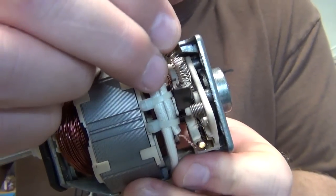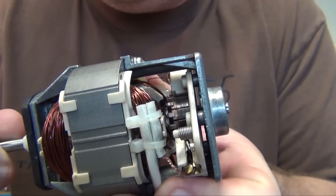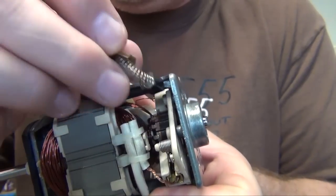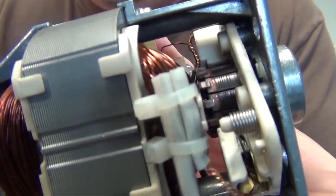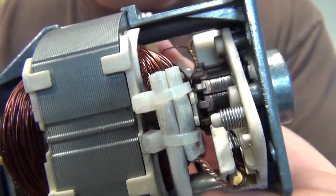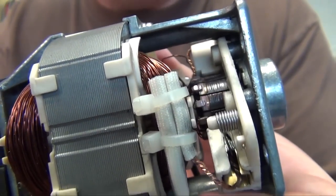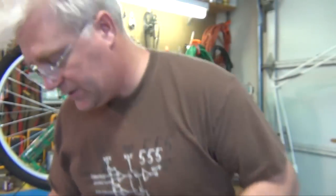It's kind of hard to get that on film. And there's a little device in there you see turning. That's a commutator. And the brushes, when they're down in there, allow the electric current to change from one of those little segments to another little segment as the motor turns, changing where the field is in the motor. And this can spin at pretty high torque and at high speed. And so they're kind of nice to have for projects like this.